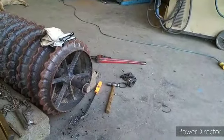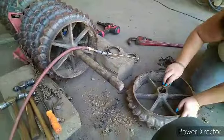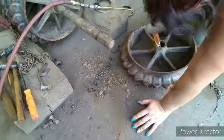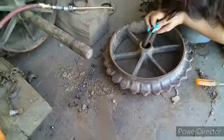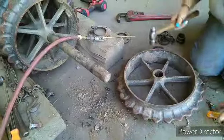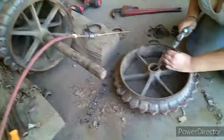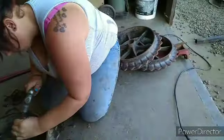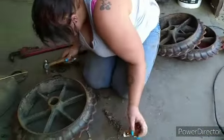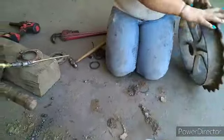I don't know how far I'm going to get on this today. The inherent issues with these things — they get full of dirt in the shaft and the roller. It's just like somebody poured a babbitt bearing in there. The worst part is getting the first few over the end of the shaft. Once you get that, it's not too bad. She actually slid that one right off. The first one I had to blow air behind it and get as much crap out as I could, then took the second one and slammed into it and finally got it out. I blew a bunch of air behind the second one and took that one and slammed into it. She walks over and slides that one right off — go figure.